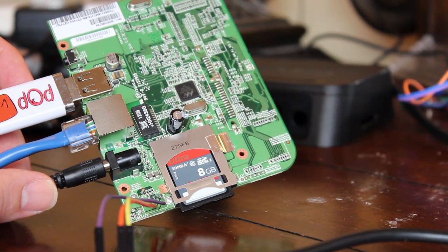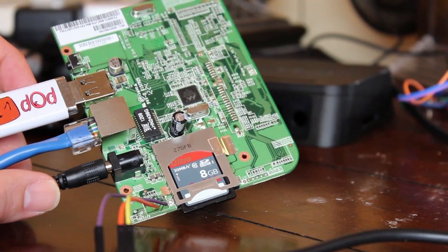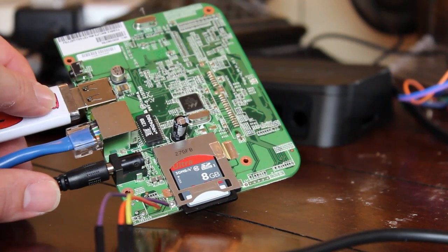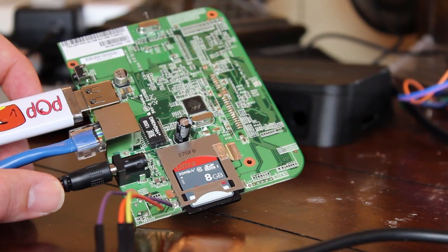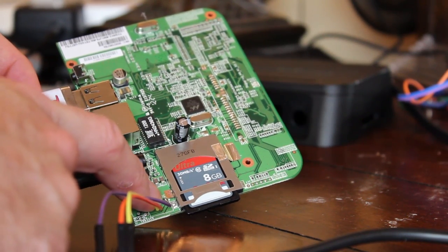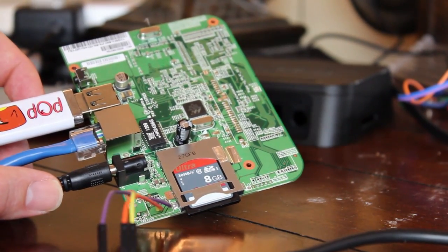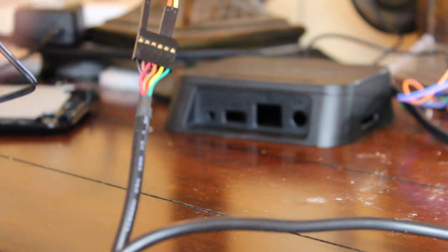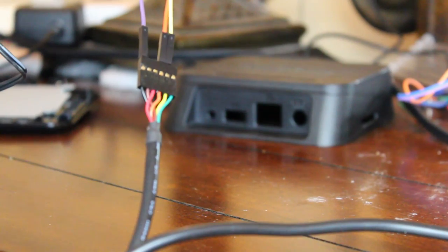There are notes in the description going over everything step by step. This board I've already messed with, but I'll go over what I did and show you the changes. I have an SD card in the slot, a USB flash drive in the USB port, Ethernet hooked up, and power. My serial port connections are here — from the SD card area we have ground, transmit, and receive. I color-coded the wires to match my serial connector, so I connect yellow to yellow and orange to orange.